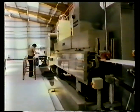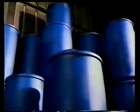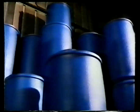Extrusion is the start of another process used to make articles ranging from flower pots and flower pot men to large containers such as these 55-gallon drums. This process is called blow molding. A hollow tube of hot polymer is extruded. The tube is called a parison. Here, the parison is extruded slowly because the tank has fairly thick walls and is a large object.